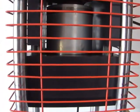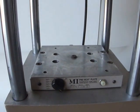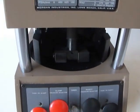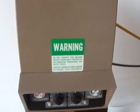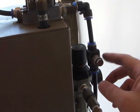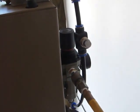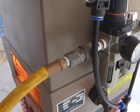The setup is in excellent condition, very clean. It does have the mold tooling heater plate which is fully functional. Up here is the pilot valve for the injection controller as well as an injection speed control valve — a very nice feature so that you can control the speed of the ram as you're injecting different types of plastics. It also has the air pressure prep setup and the oiler.